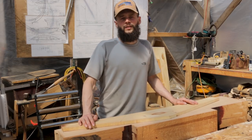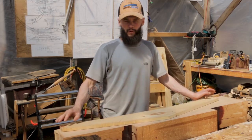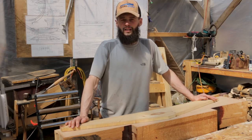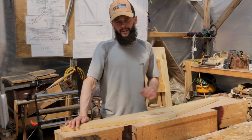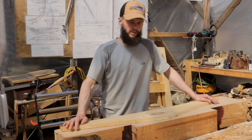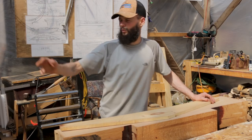Here's one of the pieces of the bow assembly — the stem knee. With Ryan's help, Ryan, Alex, and I ran the three pieces of the stem and the main stern timber through the thickness planer and got them down to six inches, which is where they're supposed to be. The rest of the timbers we put back in the garage out of the sun since we won't need them for a while, but we brought out the bow timber to show the progress, and over here we've got some work on the two keels.